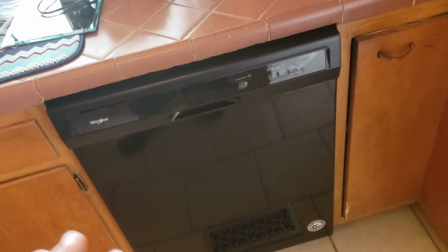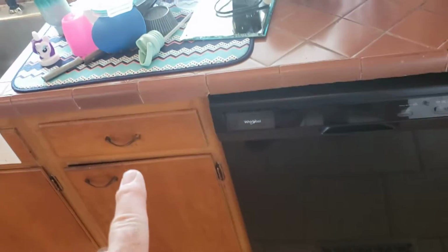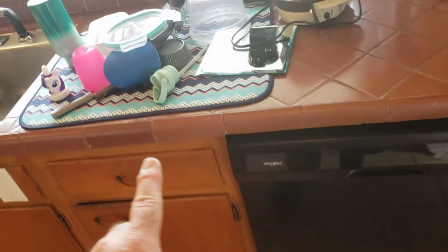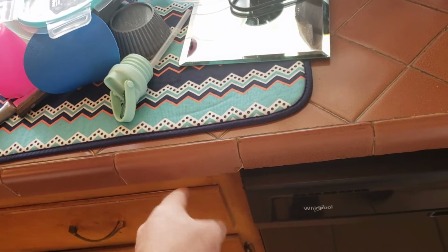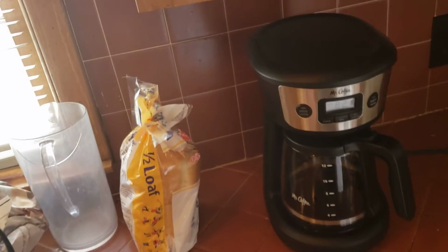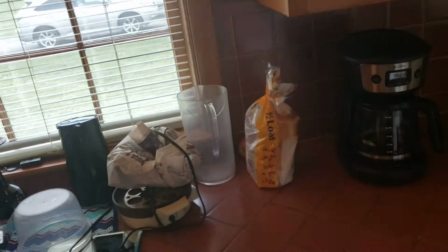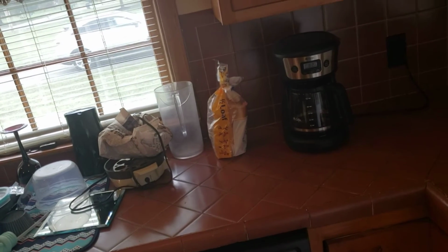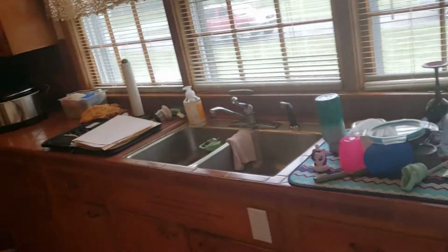The first thing is, if we were to build up the floor an inch thick, that's going to raise these cabinets another inch. This countertop's only 3/4 of an inch thick because of this being a drop over the face. It's only 3/4 of an inch. So this spacing that's here now is only about 16 inches, and we normally would have 18 inches there. So if we start building all these pieces up, that's going to end up being like 14.5 inches, much less than what modern appliances are designed for at 18 inches.